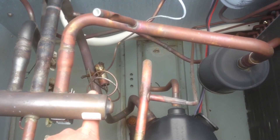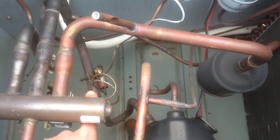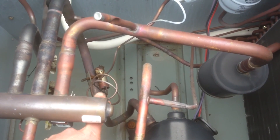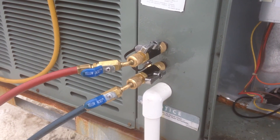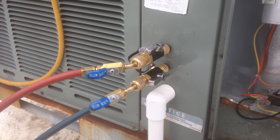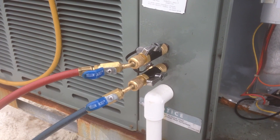I went ahead and strapped it back. Didn't bother insulating it because it should be working well enough with the bulb on it — and obviously it's not. So we went ahead and pulled the Schrader cores out of the service valves. It's not the greatest way to do it since it's only got a quarter inch copper coming to it, but I'd like to try to expedite the recovery of the system as much as possible.